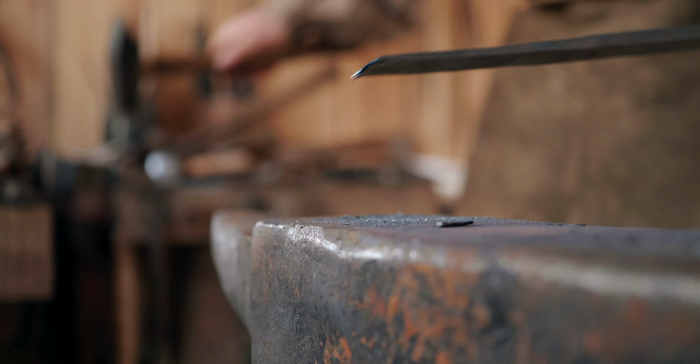But anyway, I also really like using dividers to literally divide a measurement. And this works when I'm looking at a drawing that's not full scale. If I have a dimension and I know, well, this piece is supposed to be 15 inches long, then I can simply play with this on paper until this makes up 15 steps across the drawing. And then it's a super easy thing to use this to take any dimension from the drawing. You know what I mean? Right.